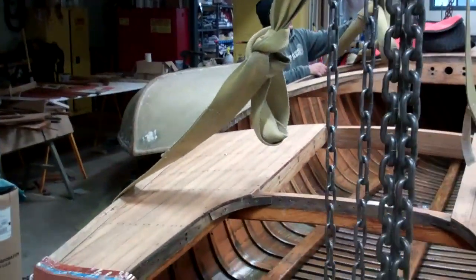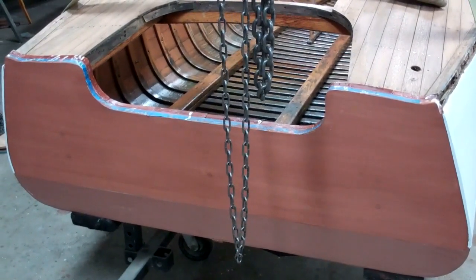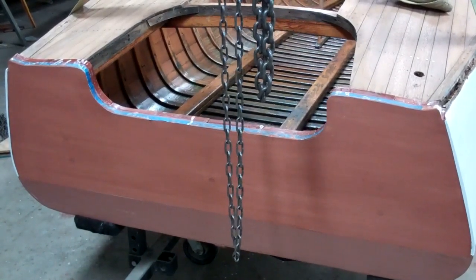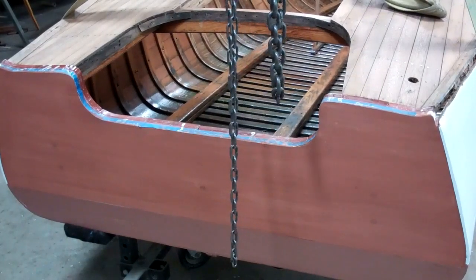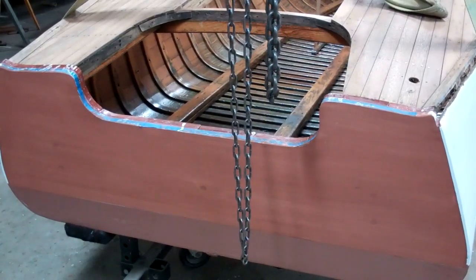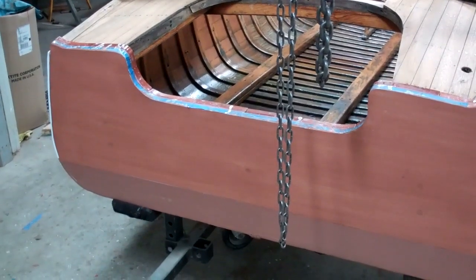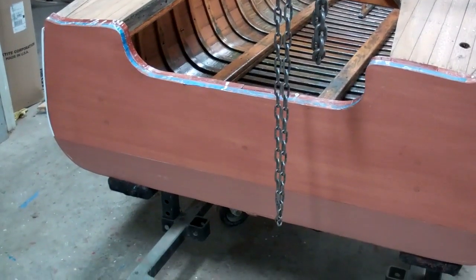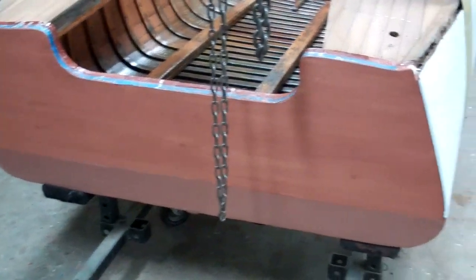So she's now upright. Her new transom has been sealed after being stained with gel stain, Woodkote wood coat stain, our own mixture. That'll just stay here. And at the waterline and below, she also received the Hi-Coat primer and Sandusky copper bronze anti-fouling paint.